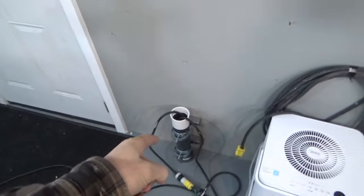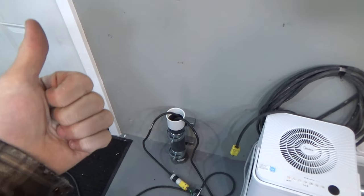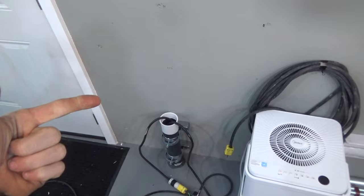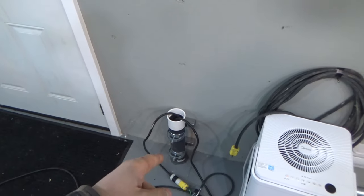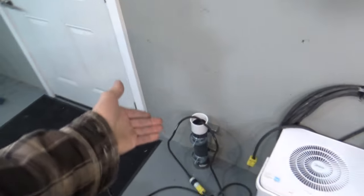The plan is we have a 3-inch DB2 conduit that runs from the crawl space of the house, which is where we're gonna be feeding everything from, including potentially water in that, but as well, there's gonna be ACW for power feed, an armored Cat 6, anything else we want in the future that comes up out of there. So it's just P-clamped on a couple pieces of strut, duct sealed in the ground, bell end. It has a couple pieces of cab tire pulled through it for temp power right now.